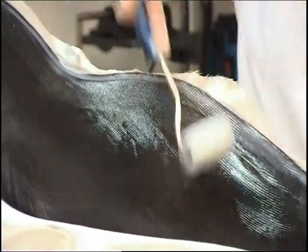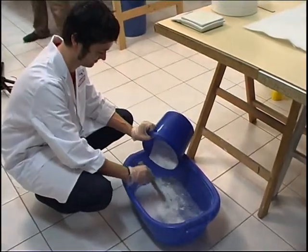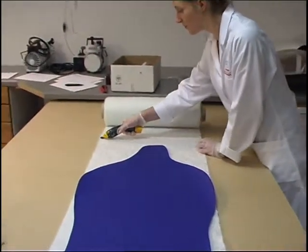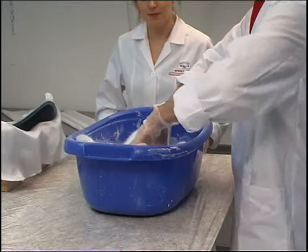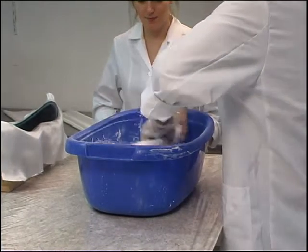The first two laminates behind the mold overlay are glass fabric plies. In order to provide the mold with an adequate wall thickness and hence flexural strength, we continue to lay up the base structure with laminating ceramic and M1 fabric. M1 fabric can be easily trimmed with micro-toothed fabric scissors or an electric knife. M1 fabric is a complex of coarse glass fiber weave and mat, and it is processed together with laminating ceramic, yielding a coat thickness of 5 mm in the same working cycle.